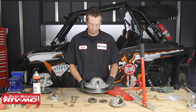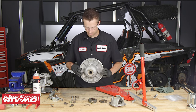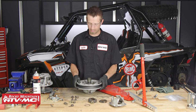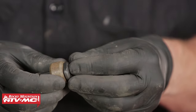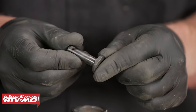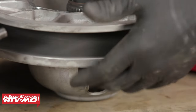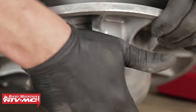We can take our secondary clutch, flip it over, make sure the yellow indexing marks are lining up with each other, and then align the movable sheave with the fixed sheave so we can see the hole that will receive the pin in the roller bushing. Once we've got it set, we can take our pins and place the roller bushing onto them with the flat side facing to the outside of the pin. On one side of the flange there's a flat side — this flat side is going to be facing towards the engine when the sheave is installed. When we insert these into the sheave, we want to make sure that the flat side is facing towards the two halves.